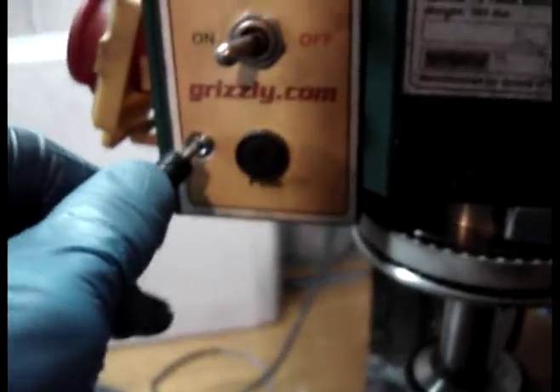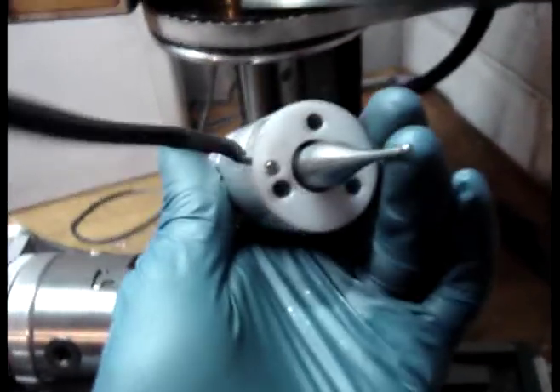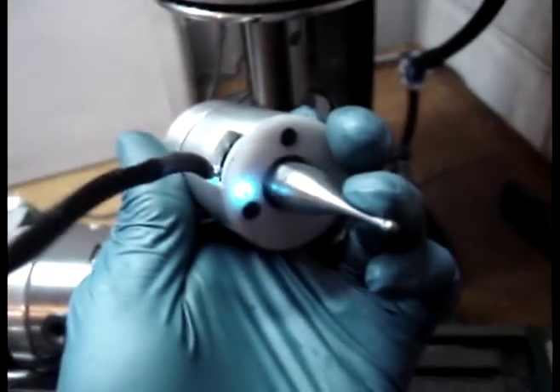I added a little microphone jack into the case here. It's got an LED on the bottom, so any time it trips the LED goes on — more as a visual indicator, which is quite handy. You can manually jog the machine until it touches and it lights up, which is kind of sweet.